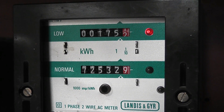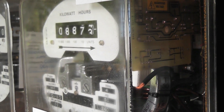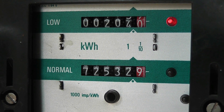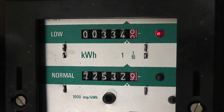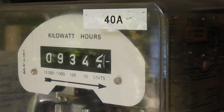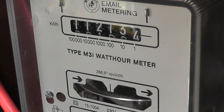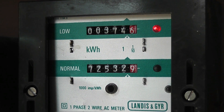This Landis+Gyr meter has advanced to 00175.2, though the bottom register is not working. Adjacent to it are the email meters which are the check meters on this particular setup — reading 334.8. I only need to do a comparison reading for accuracy, versus 9341.7 thereabouts. Just in the process of a dial test versus an email M3i, and it's perfectly in step.